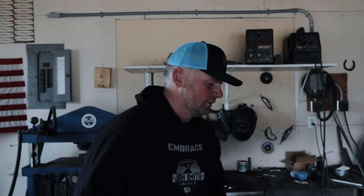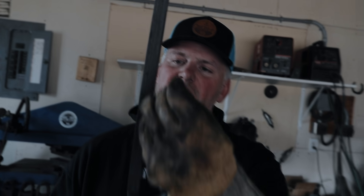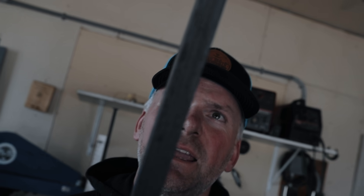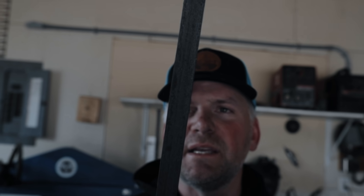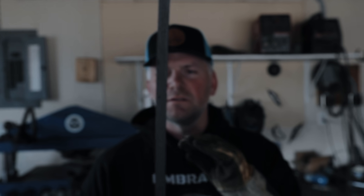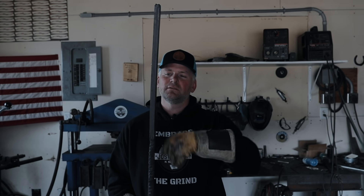We are done with our first initial forge segment. Got a nice long bar — it's perfectly even all the way up and you can see all these layers along that edge. There are 19 layers, but we used 33 individual pieces of steel to get 19 layers. Those layers stacked up with four or five pieces of steel only count as one layer. So 33 pieces of steel, 19 layers — and now we're going to cut this bar up into pieces and restack it.